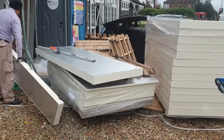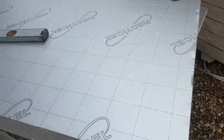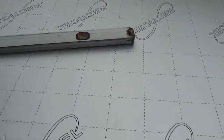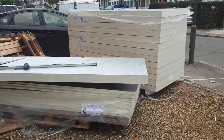We've got two types of insulation going in today. The thicker 100mm rigid insulation, which comes in big panels and is cut to size. And then we've also got some smaller, thinner 20mm thick sheets which are at the lower part of this section, as you can see at the front here.